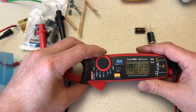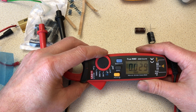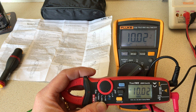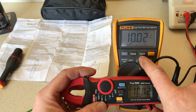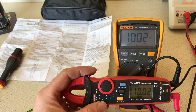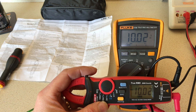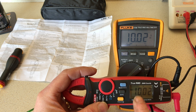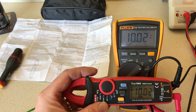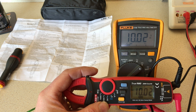I've got a DC power supply off-shot set to 10 volts. A Fluke meter — fairly new from the factory — reads 10.02 volts. The Uni-T reads exactly the same voltage, so from an accuracy point of view on DC it doesn't look too bad.